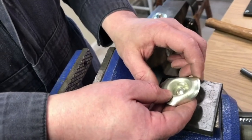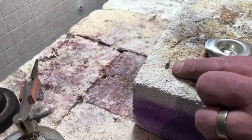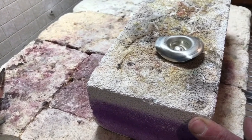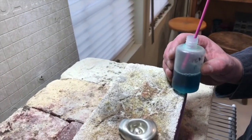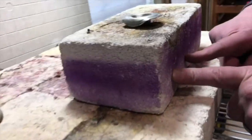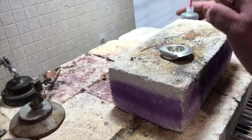The last stage will just be soldering a little tie tack pin on the back. The first stage is to melt some pewter solder onto the head of the tie tack. Soldering pewter is a lot different because of the low melting point — this is solder typically used for lower temperature operations like plumbing or electronics, so it has a separate flux. Also, you don't want any pewter work to contaminate any area where you might be using higher temperature metals like copper or silver. So I use purple to color-code anything that's for pewter only — this fire brick is only used with pewter and pewter fluxes.